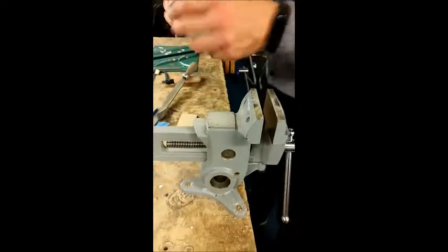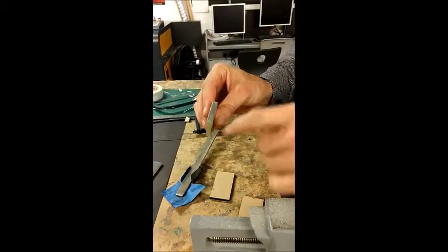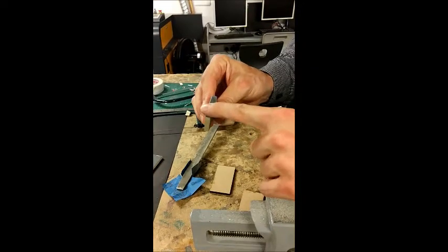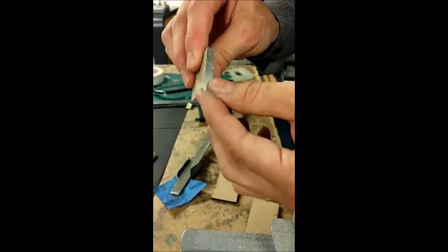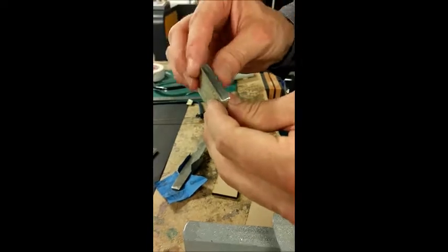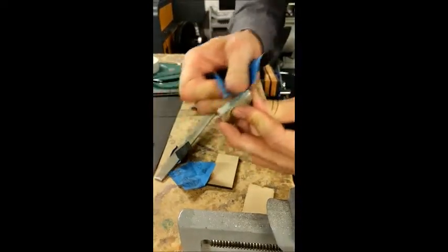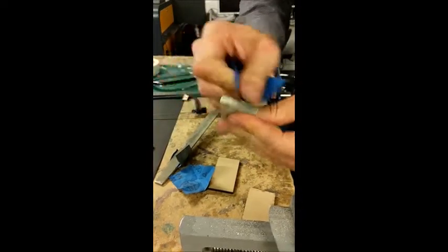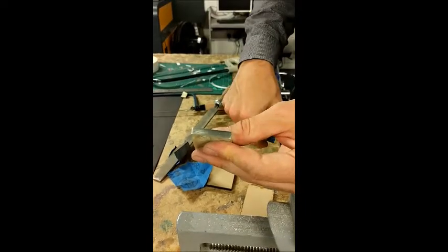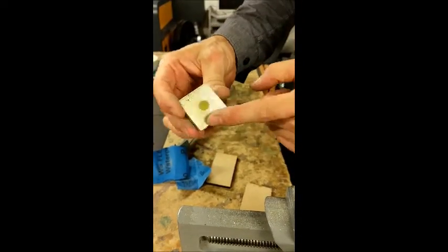I've done that on one surface, and I'd want to go around and do the other surfaces too. One thing I am doing here which I'd encourage you not to do is rubbing my finger across to test it. Although the surface is incredibly smooth, on the edge you can see a very wafer-thin layer of pewter, and that might be razor-sharp. So be very careful if you're going to run your fingers across a pewter surface, and make sure you've deburred the edge first. Use some wet and dry paper to deburr that edge before running your fingers around the sides. You can see that edge is now quite nicely polished.